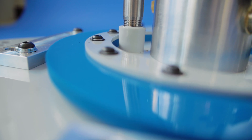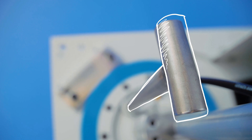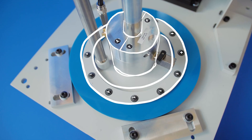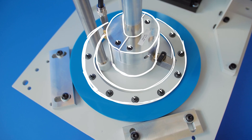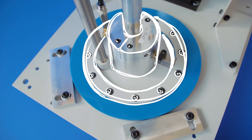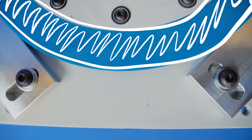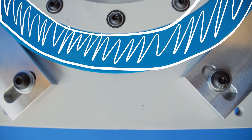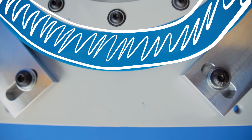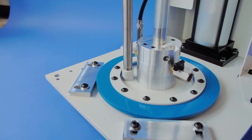There are several parts of the inductor. You've got your seals, your bleed ports, your T-handle, and of course the actual inductor. The inductor applies and holds pressure on the material in the container, ensuring it remains primed and ready to be pumped at any moment. The inductor seals live at the bottom of the inductor. They are generally a flexible material that keeps unwanted air from getting in the container, as well as making sure the material doesn't get out. Different inductor seal options are available, depending on the material you're pumping.